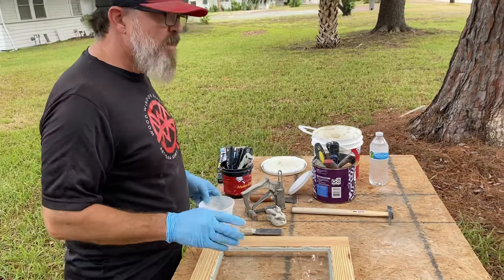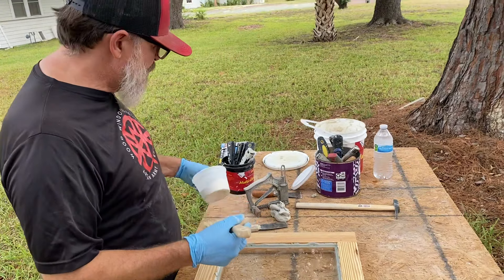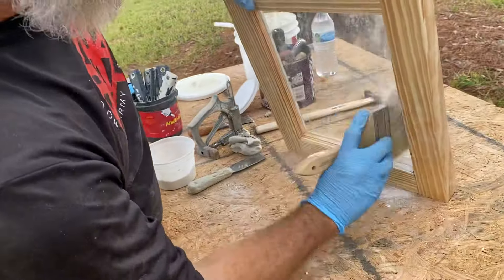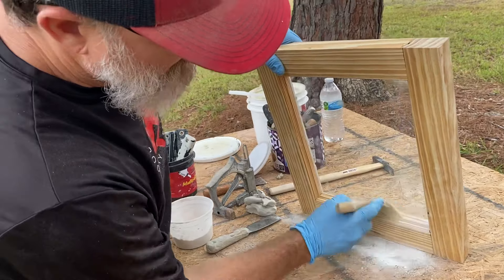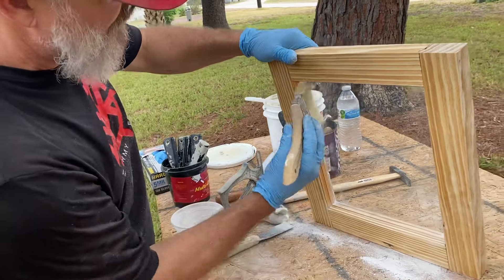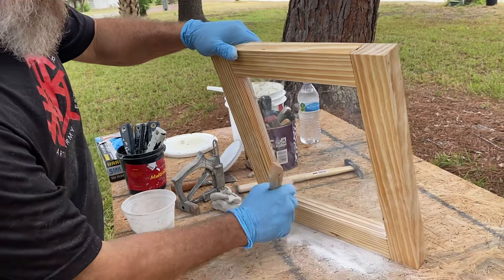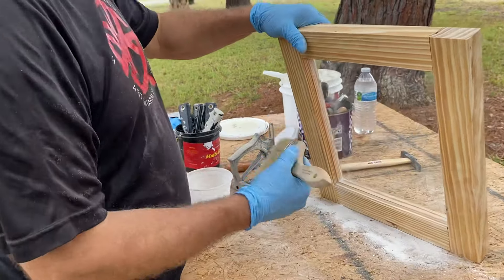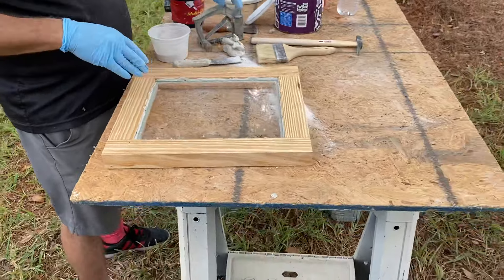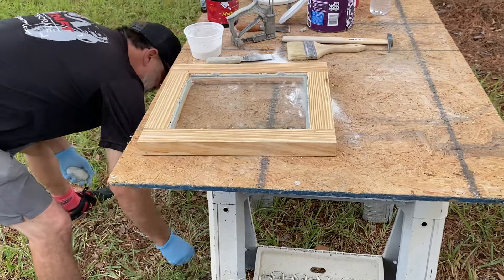The other thing I want to do while I have it out on this side is introduce this powder — my magic dust. I'm going to use it to lick up these oils because they will set up on you. The same thing that causes this putty to dry and set up in two days so you can paint it will start to harden up on your sash and make it hard to clean off. So you have to clean it off as you go.